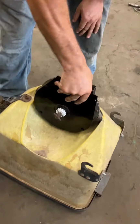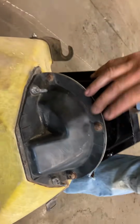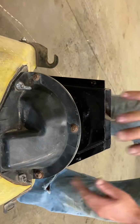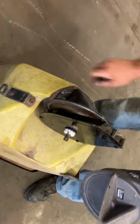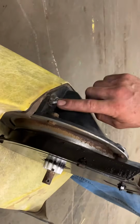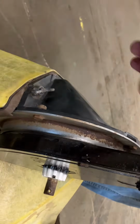So your corn meter is on here right now. To switch corn meter to bean meter, you're going to take the 2 wing nuts off, take the whole meter off, and then your bean meter is going to go on in the same fashion. The ridge sits inside the middle little lip there. If the bolts go in easy, it's on right. The bolts will stay right with the box, so it's pretty foolproof. It's just these ones that you flip.